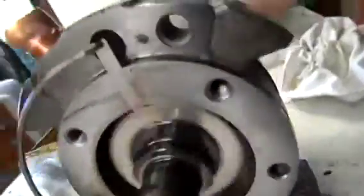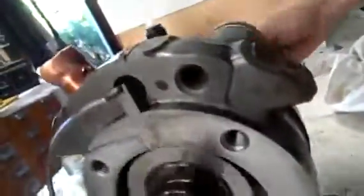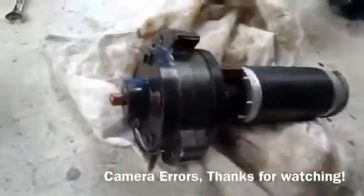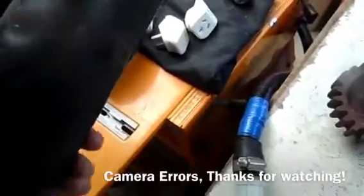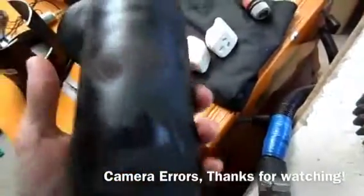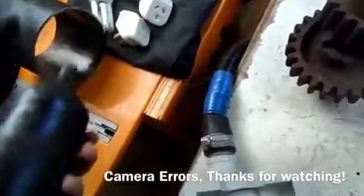They're a really neat little device. Like I said before, that spring is just keeping tension on the vane, stopping it chattering — doesn't matter how fast you turn it up. Well, that's that one back together — there's nothing wrong with it, it's working fine. Bearings are definitely quiet now that they've got fresh oil on them. This thing should last a decent amount of time hopefully. When I get time at school I'll take this in, part it on the lathe, and do another video to show you what's inside these. It's not a lot, but they're very crucial to have on an HVAC system because they protect against slugging and also contaminants getting into the compressor.